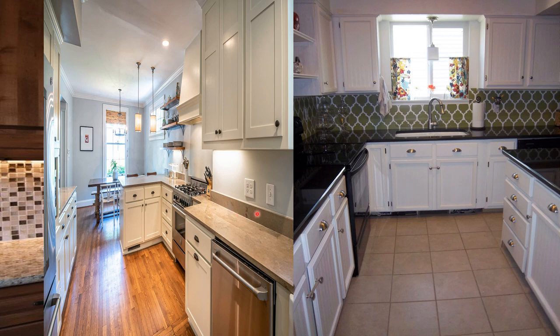An excellent example would be right here at this switch. Let's imagine this switch controls an overhead light — this would be a great place to tap in and get your under cabinet lighting circuit. You pop in here, maybe cut in a two-gang box, run your switch leg up, and you're able to power your under cabinet lights.